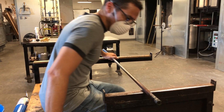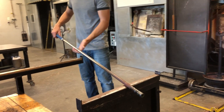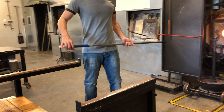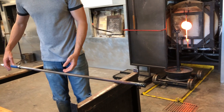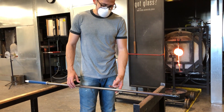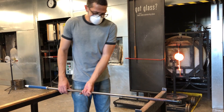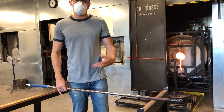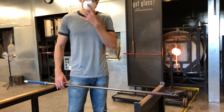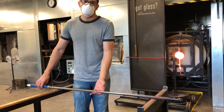Getting out is exactly the opposite. Slide my hand back, step around, slide my hand up, and I can control it. The sliding works because as soon as the blowpipe starts to get warm, your hand will feel it and you'll stop sliding up. If you just reach forward and grab it, it's very easy to grab it where it's hot. So we want to always try to keep our left hand on it, just sliding back and forth.